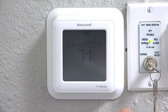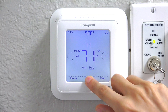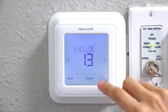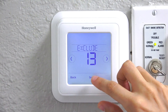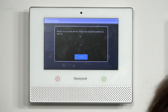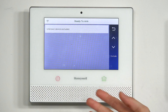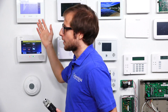Now we're at the T6 Pro Z-Wave Plus thermostat. You just tap the screen to activate it, go to Menu, and scroll until you find Z-Wave Setup. Press Select at the bottom, and you'll see it says Exclude with the node number — this one is on node 13. Press Select, and now it'll enter exclusion mode. I pressed the exclusion button on Lyric, it went into exclusion mode, and you can see it says 'unknown device excluded.' That unknown device is actually the T6 Pro thermostat — it successfully excluded.